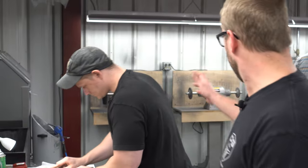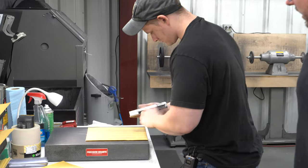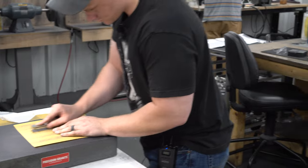Before they go to any final vendor finishing, we'll have to do some polishing. Let's walk over and talk to Nate and see what he's working on. This is our polishing station — we have some wheels over there, various abrasives that we use. When it comes to polishing the flats, which is a super popular option on these pistols, that's all going to happen on these granite flat plates. Nate is taking this one down on the granite, getting the side perfectly flat on some aluminum oxide paper. He'll take that all the way up to a 30 micron polishing cloth. This is one of those steps that usually starts a little bit before you get into the final finish, before you start the bead blast, just to make sure everything's flat. We start at about a 220 grit sandpaper, work our way all the way up to 30 microns, get it nice and flat, get all the scratches and tool marks out, then take it to a nice blast condition before working it up to an actual polished flat.